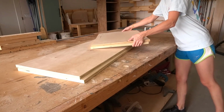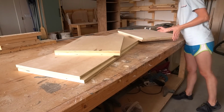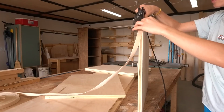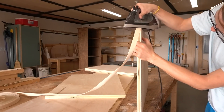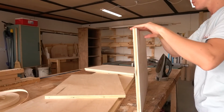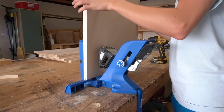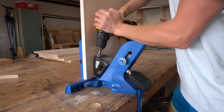Once I had the top and bottom, the sides, and the divider panels cut down, I applied iron-on edge banding to the edges that will be exposed in the finished project. Edge banding is always optional, but I just think that it looks a little bit cleaner, so I like to use it. I'll link a guide to applying it in the description below if you'd like to know more about it. Once they were edge banded, I began drilling the pocket holes to assemble the main cabinet.